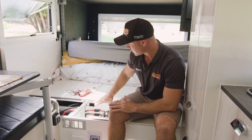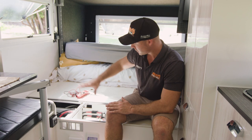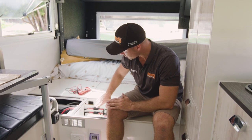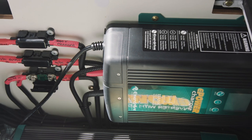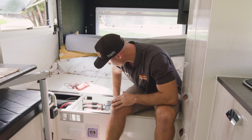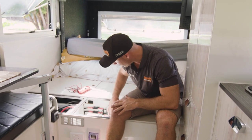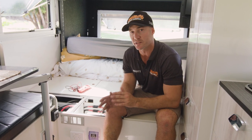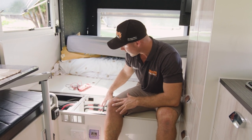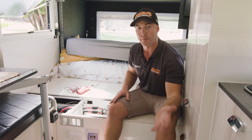A couple of things to note: your AC charger is fused. If you're plugged into mains power and the charger is getting no charge, one of the first things to check is the fuse — located close to the AC charger. Visually check it. If it looks good, hold the menu button on the charger. It'll bring up the voltage and pick up the batteries first. On channel one, if it reads zero volts, there is an issue between the batteries and the positive wire.